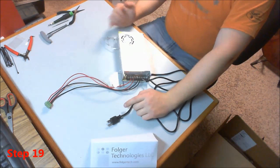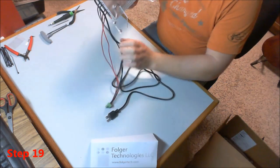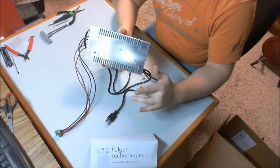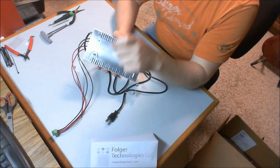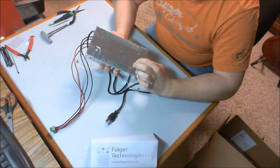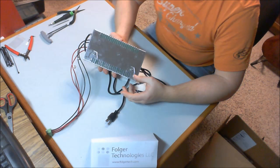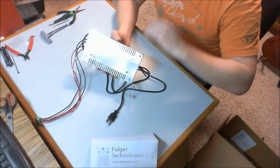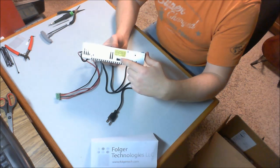That's great. Moving on, you need to grab the two acrylic power supply holders. They're these kind of strange angular shaped items, and two of the 5mm by 5mm bolts. You go ahead and screw those on to the power supply. Depending on what side of the power supply you put this on, you might need to flip-flop things to the other side. While I'm looking at it, I do want to call attention to this big yellow sticker in this switch.